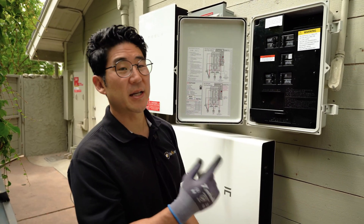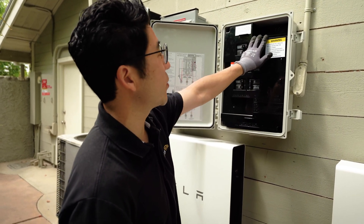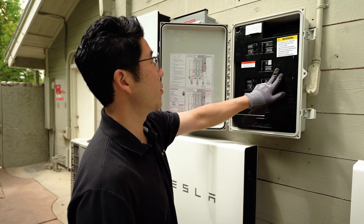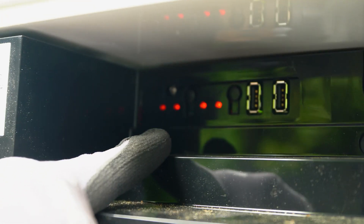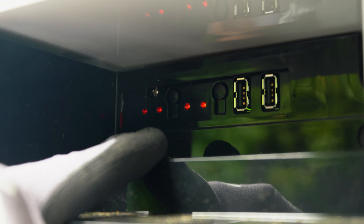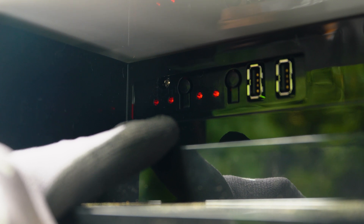Hopefully there is sunlight available. When you are finally up and running, you're going to notice three green lights. The one on the very far left is to make sure that your system is connected to Wi-Fi. The two most important lights are between these two buttons. The one on the left with the lightning symbol is your power production LED — when it's working, it will be a green light and indicates that all your microinverters are producing power. The one next to it is the device communication LED, and when it's green, it shows that all of your microinverters are talking to this combiner box.